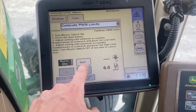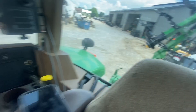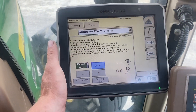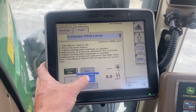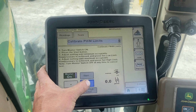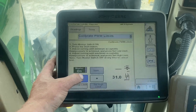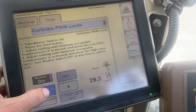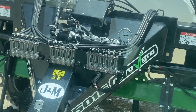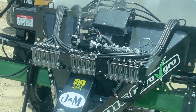Basically what we're going to do is with our pump on — the pump is engaged but nothing's running because the PWM has not been told to allow flow to the pump yet. We're going to start with the pump on and product in the tank, then press and hold the plus button until we see flow. Now we're going to keep pressing the down button until that gauge is really low, because we're setting the low side of our PWM — right there at 2 psi.